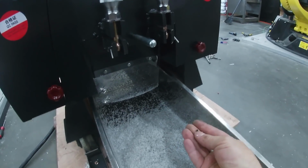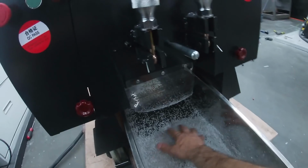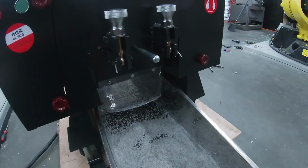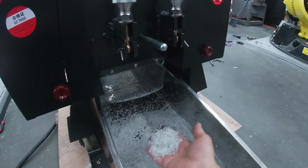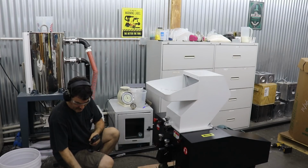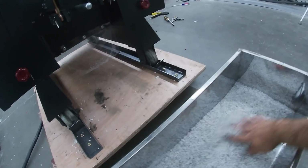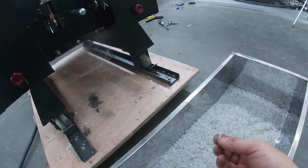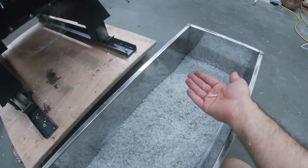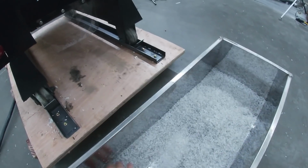That's just like grind or weld slag. But it is granulating, and I can run back, not this stuff because it's too dirty, but I can run the clean version of this plastic back in through the molding process. So it looks nice. Let me pull the whole thing out. Not bad for grinding other than the complete mess. There's a few pieces like this one, which may have trouble making it through a conveying vacuum hopper, but actually maybe not. So I guess I have mixed reviews.